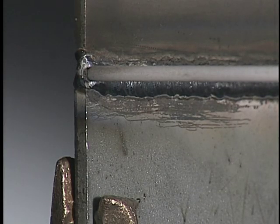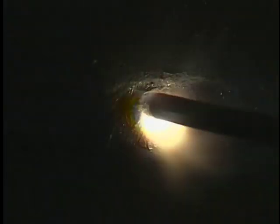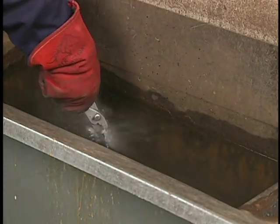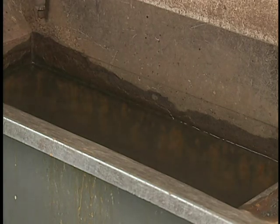For the second weld, center the electrode on the upper toe of the previous weld with a 90 degree work angle and the same 5 to 10 degree drag travel angle. Overlap the previous weld by about 1/3 to 1/2. Cool the workpiece as necessary to keep it from overheating and producing undercut.